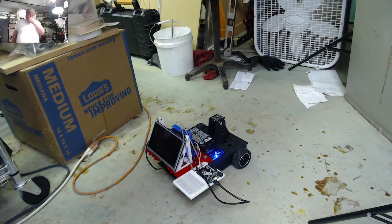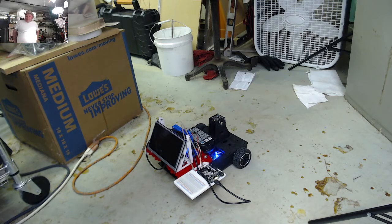So I'm looking at that. The problem I found with those store-bought casters is that they wiggle. There's not enough ball bearings, and the joint is not tight enough. So what you really need is a thrust bearing, so that there's no play at all.